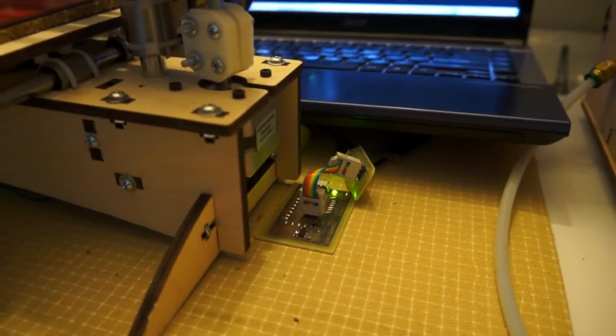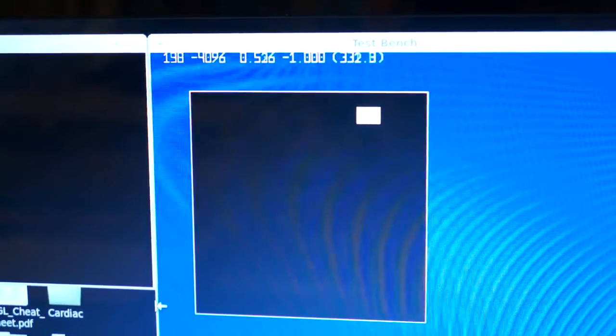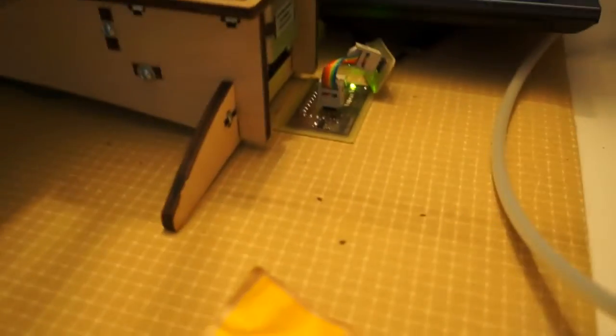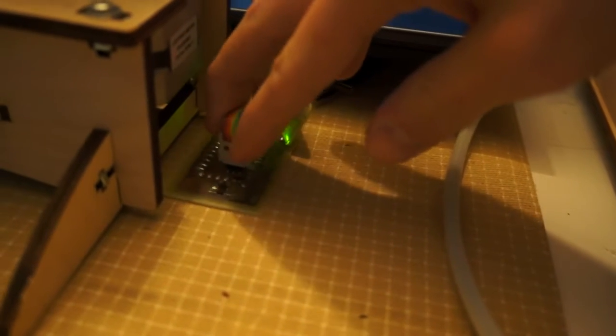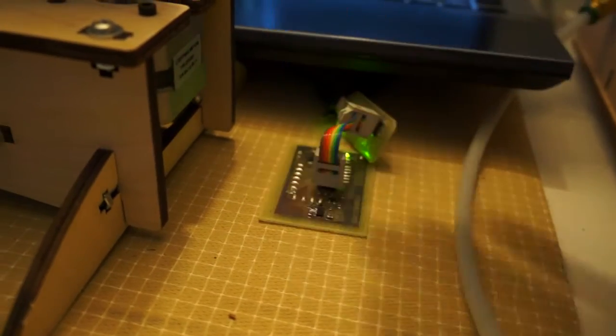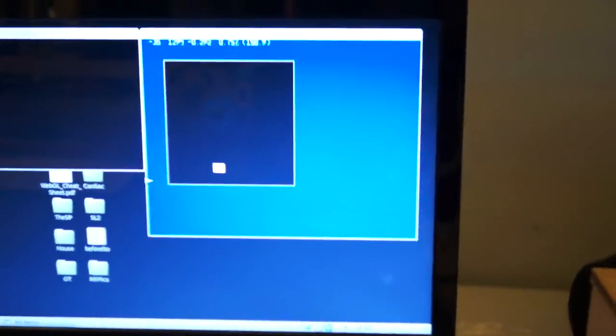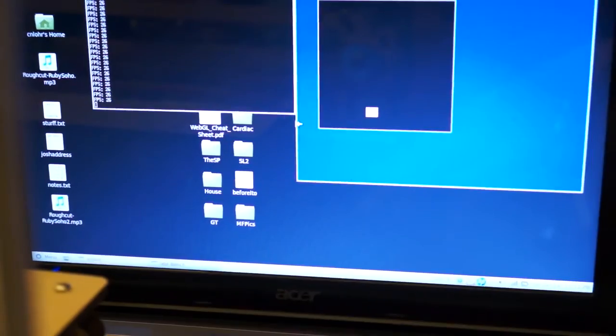The first thing we notice is the fixed magnets in the motors overpower the magnetometer, and so it's reading negative 4096, which means it's just outside of the band in which it can read. So I'm going to have to move this magnetometer away a little bit before it will actually behave — probably about another inch away — and now the numbers are down in something reasonable, not beyond this thing's ability to measure magnetism.